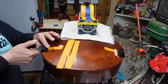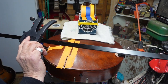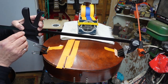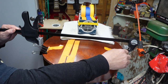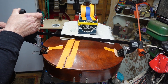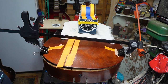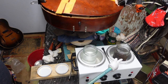If you don't like the rope, I have another way — it's more expensive and gives you a reason to go buy more clamps. The spot I want to clamp is right in this crack area, so I use this giant clamp because a little one won't go across. I only need to secure one side, and I have these here to stop the clamp from sliding on the curved surface. Look what's happening — this part is arching up as the cracks close.